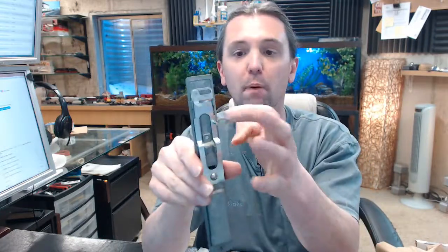This is what will make the hook lock and unlock. This pin communicates to the tailpiece on the back of the cylinder that is on the exterior. You need to be able to manipulate both of those features in order to properly operate the lock, meaning you have to retract the latch in and out, but you also have to, when you unlock it from the inside, be able to lock it when you close the door after you come back in and know that the cylinder on the exterior is locked — and that is what this bar will do.